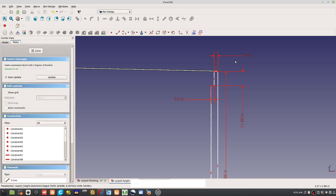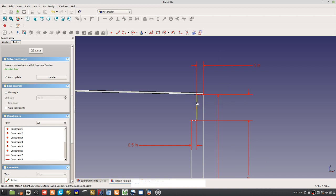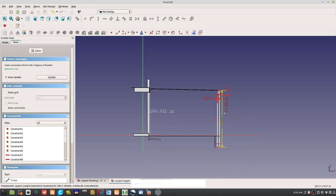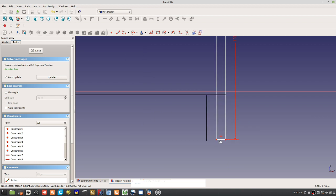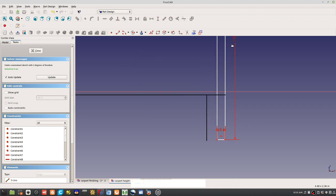So this notch here, let's get rid of that. You see how the notch should be cut out here, 3 inches instead. I've got 3 inches of meat. The notch should instead be, well, we know this is going to be 5.5. That's your 6x6 post.